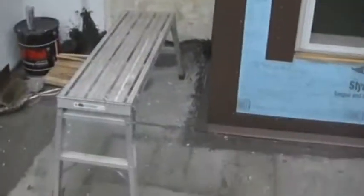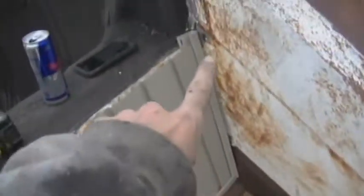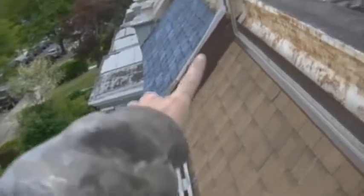Okay, moving along with the soffits. You can see we're outlining everything to keep going. Now I'm up here. You can see we're going to caulk this, seal this all in. You can see how my J-channel pattern is going with the flashing over top of all the shingle work. You can see down the side of the box is done to come across and finish it off.